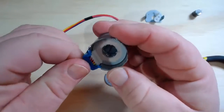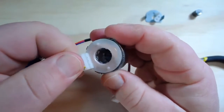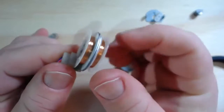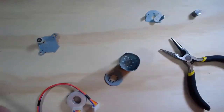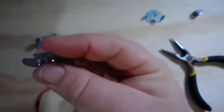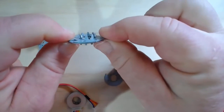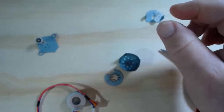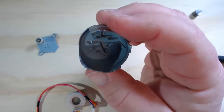Those teeth are actually on little platters buried between the coils. Let me pull this out and remove the coils. You'll notice that there are actually two coils here, and in between them are more little metal plates. I've taken another motor apart already, so I can show you — those metal plates look very much like the top ones. They get stacked in between: one coil above, one coil below, one set of teeth pointing up, one set of teeth pointing down. That gives me eight teeth on the top, another 16 teeth here, and then on the very bottom yet another set of teeth — a total of 32 teeth.